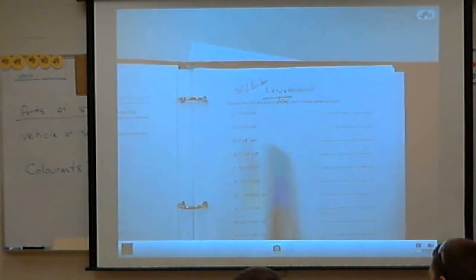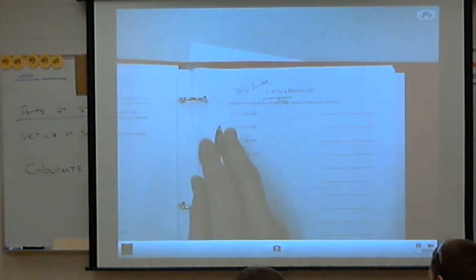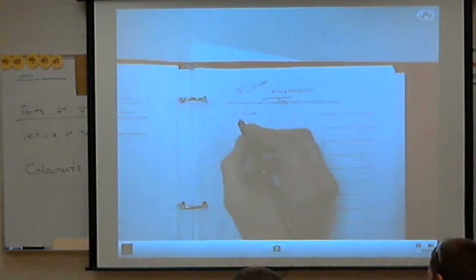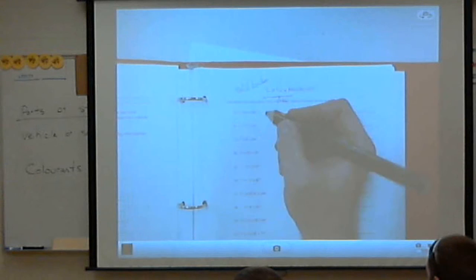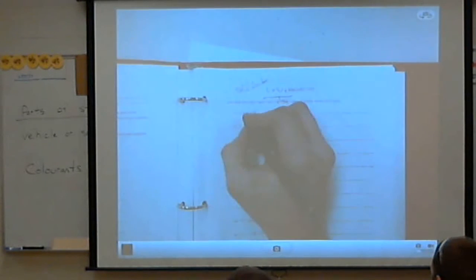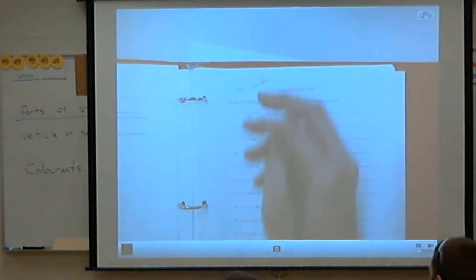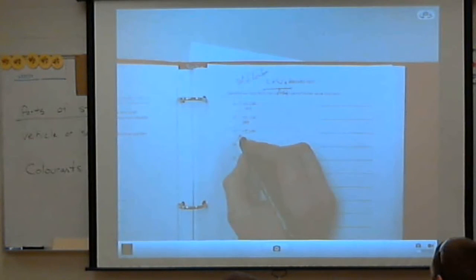So really all you're going to need to do is take these equations and multiply them right across. So if we have a board that's 1 inch thick by 5 inches wide by 39 inches long, all we do is multiply those straight across and divide by 144. Just go right down, divide by 144, everything like that.